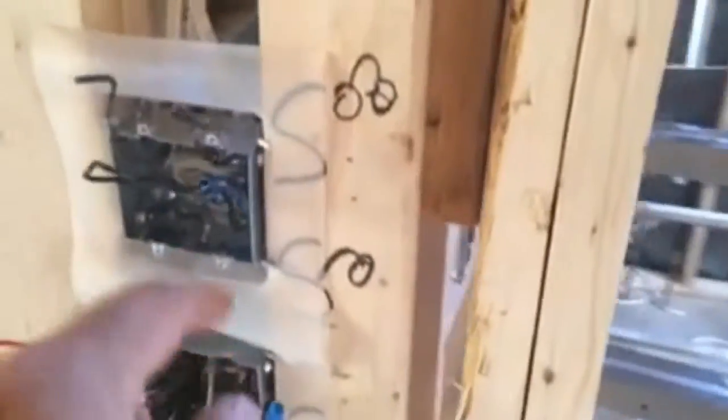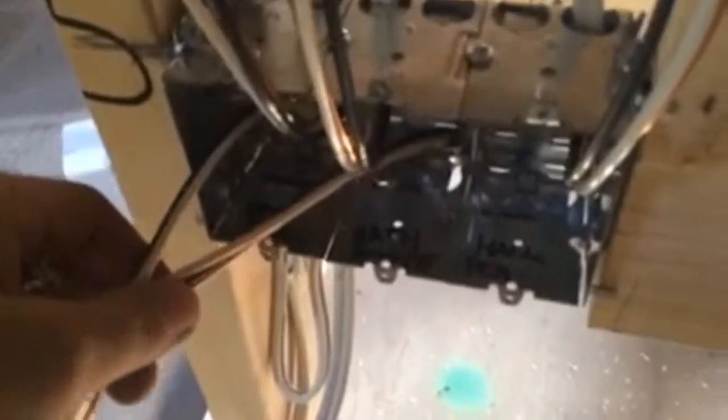They'll go through and install all the boxes first. Once they have the boxes in, they proceed to actually wire them all up, sending the wiring to the appropriate circuits and running everything where it needs to go. As you can see, we've got two sets of two-gang boxes here, all the wires are run between them, everything's sticking out ready to go, and they're all labeled as what they actually control. For example, here you'll see this is the bed pots, this is two pots for something else, this would be the three-way switch over the faucets, and here's some sconces. Everything is labeled so it allows the electrician and the homeowner to walk through one last time to verify that everything has been installed as per plan and confirm everything's in the right locations.